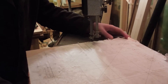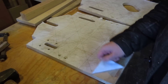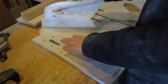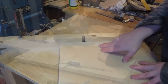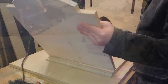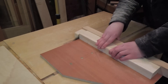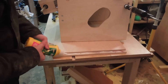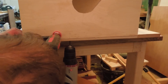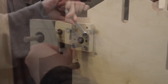The sides of the body were cut using a variety of tools. The paper templates are really handy for this sort of thing — Matthias Wandel sells a program that makes producing them fairly easy. The base was cut and had a rabbet routed into it. Some struts were also cut from spruce; these were only screwed in since I wanted to be able to remove them. The sides were glued and screwed to the base, and studs were epoxied into the holes for the pivot flanges.